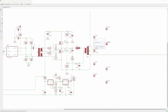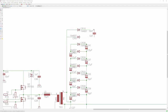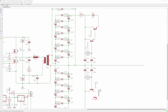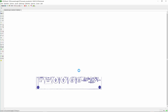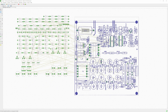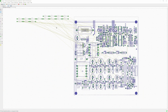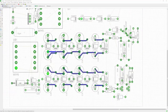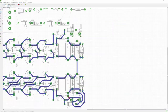The high voltage converter circuit isn't that complicated, but laying it out in CAD is always time-consuming — although it can also save a lot of time in troubleshooting when done properly, and I have yet to come across a project where no troubleshooting is required. I wanted to replicate the original layout completely, but ended up doing so only in the high voltage area, managing a layout that needs neither extra vias nor jumper wires, which is preferred for a single homemade board.